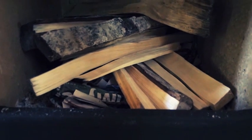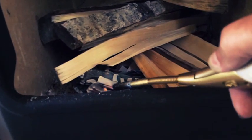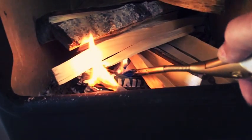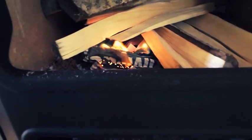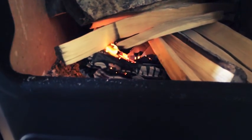To start off the fire, you have some paper and put the wood in a crisscross fashion. You also have both the secondary air flow and the primary air flow completely open. And you start it off with the door open — of course you wouldn't be able to set it on fire if the door was closed. As soon as the wood begins to catch, then you can close the door.